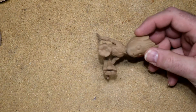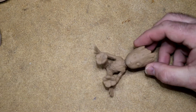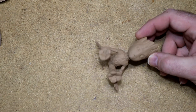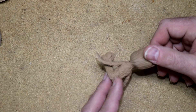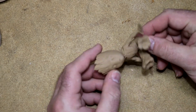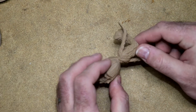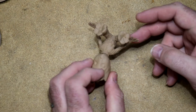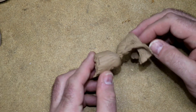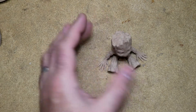So here is Baby Groot. It looks like on Thingiverse, anyone who has ever printed anything in a wood filament has printed it using Baby Groot, so I made sure to do a Baby Groot with my Hatchbox wood filament. It does look like wood to me — I'm impressed with it. It's got kind of a matte wood texture to it, I think it looks good. There is some nice gaps on this model which does a good job of testing stringing and I've not really cleaned this up — what you see is what you get off the build plate and there's almost no stringing. Maybe a few strings I could burn off with a heat gun. It printed really well. I printed this at 195 degrees on my Prusa i3 MK3.